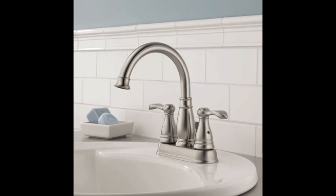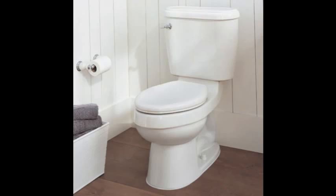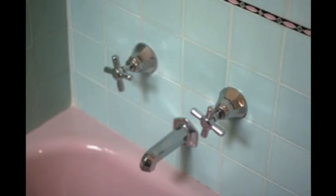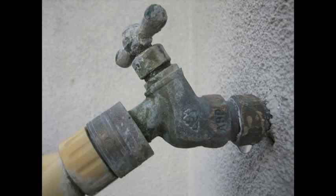In the bathrooms, all your faucets will be checked for proper operation, including the pop-ups, the drains below, and the service stops. Inspection on the toilets includes tightening up the toilet seats and checking for leaks between the tank and the bowl using dye. Your tub and shower faucets will be checked along with the drains, and your laundry shutoffs and drains will also be checked.